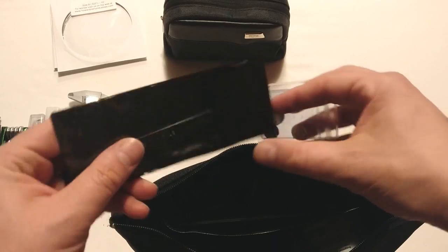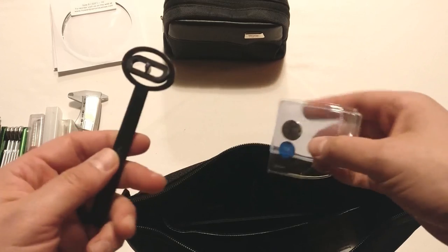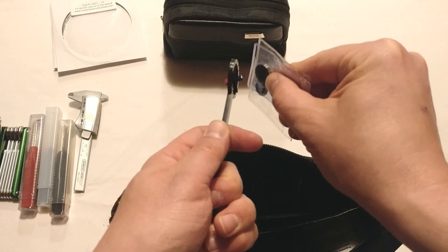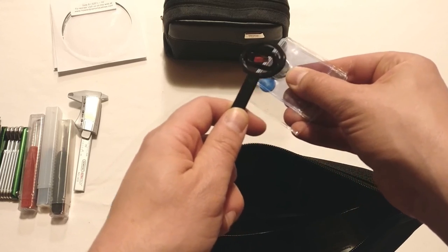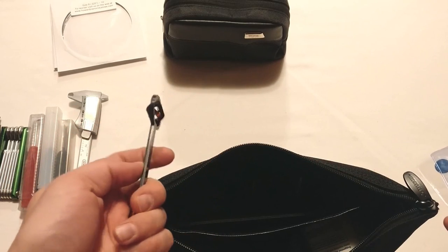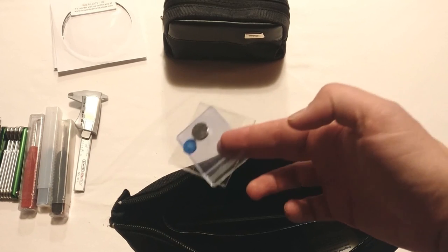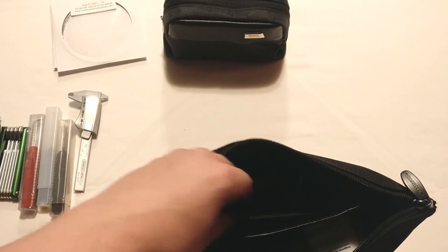That is why we have our magnetic probe tool right here. If you have never used one of these, it is really kind of fun. This wand will point in the direction and show you the polarity of magnets that are in its field of view. So wave this around the door, find where the magnet is, disable it, and knock your door contact offline if you're not using a high-security door contact. Excellent to have those around.